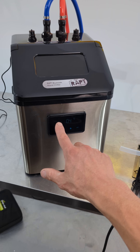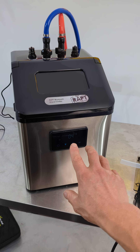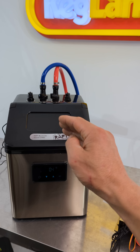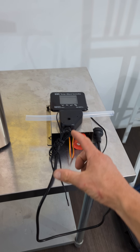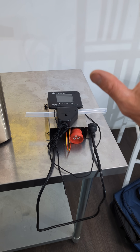This will pick up on the signal from your glycol chiller so it knows what temperature the glycol chiller is at. It also means that if, for instance, you plug in multiple fermenters and one of them is actually heating up the glycol bath, if the glycol bath is too hot it'll essentially shut down the glycol flow to the fermenter you're trying to chill.